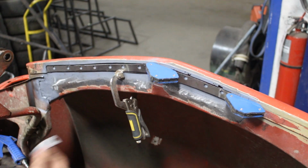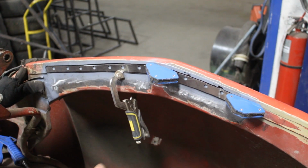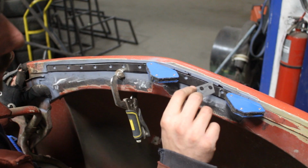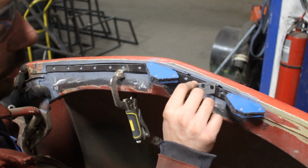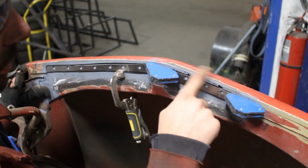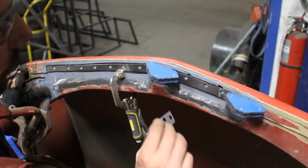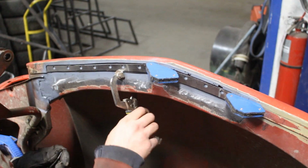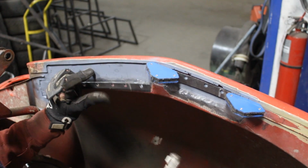Alright, 2 are done. This is the 3rd one which comes here, so we just need to weld them and grind them. Here I think I'm gonna try to fill this up with weld. I know it's gonna burn on me, but I'm gonna chase it a little bit, hopefully not further than the edge. I don't want to go into the top of the hood. If I have to, I will, but I'm gonna try first to fill them up with weld. I'm pretty sure it's gonna work. So this is where I'm gonna start with actually, and then I'm gonna take out for now.